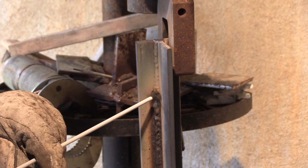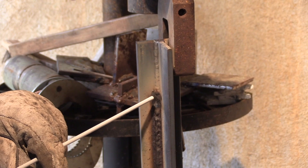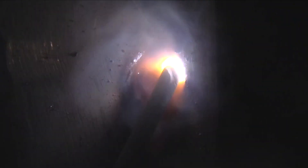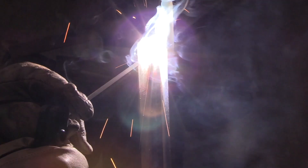That's why sometimes I just shoot for 90 degrees and I always wind up with a push. We're going to show a restart here — it's just as important to be able to make a good restart as anything else. I'm going to cue-stick this rod with my other hand, light up right ahead, drag it right down into the crater, and then try to carry on as if I never stopped. The quicker you do this after you stop, the hotter that crater is going to be and the better restart you'll have.